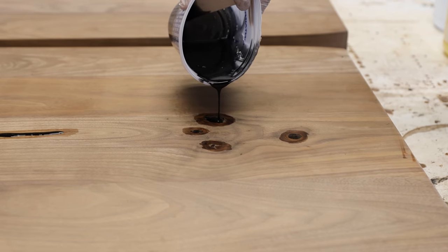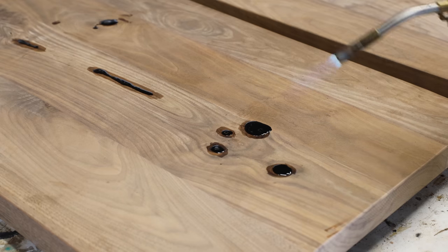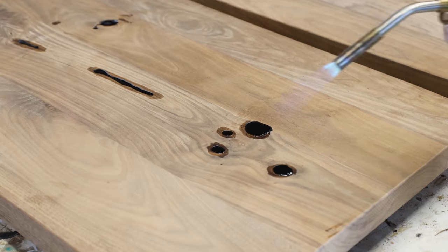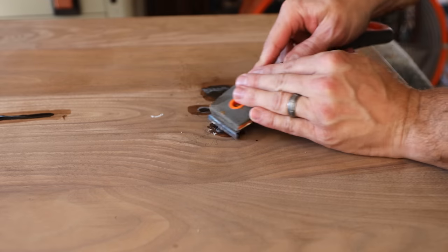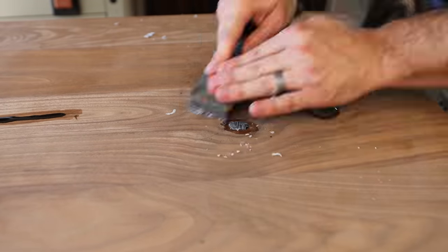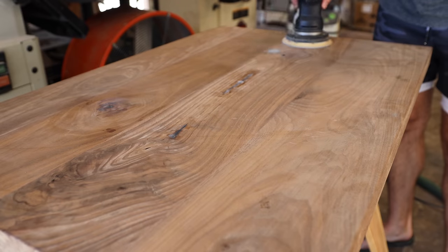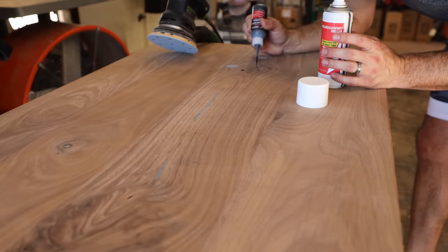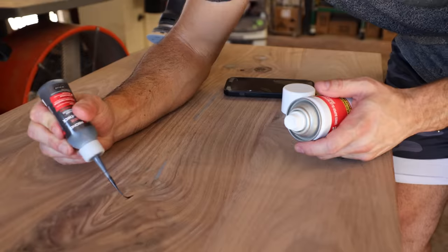Another thing too is when you're mixing in pigment, it's really important for you to actually mix your resin first once your A and B is in the bucket. That way you can see all the striations go away after the 3 to 5 minutes. In this case, I didn't do that, so I had to mix it just a little bit longer just to be sure everything was mixed properly. But just as a fail-safe, mix your resin first, then add pigment last.